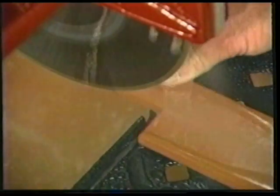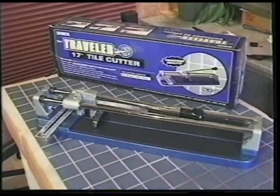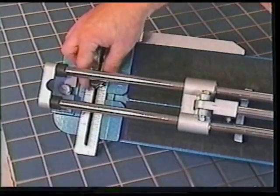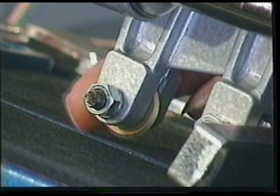There are several types of hand cutting tools for every tile. They range in price and size for your needs. These are just a few of the best and easiest to use on the market. They are all equipped with a carbide cutting wheel that scores the tile, then with a quick snap, they split the tile in two.